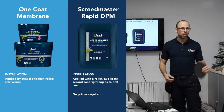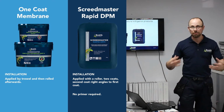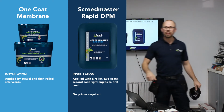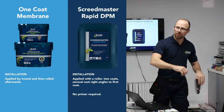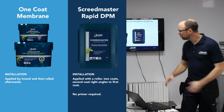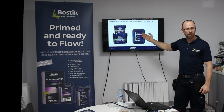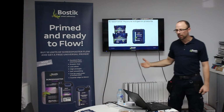Any floor layer should know how to put DPM down. They might not have used ours, but they work the same. And this one is just roll apply. You roll the first coat down, and in 15 minutes it'll be dry. Then at right angles to the first, you roll the second coat down so you get good coverage. So that's two DPM products. Is that the whole range? Just those two, in terms of moisture protection, avoiding moisture affecting your floor coverings.